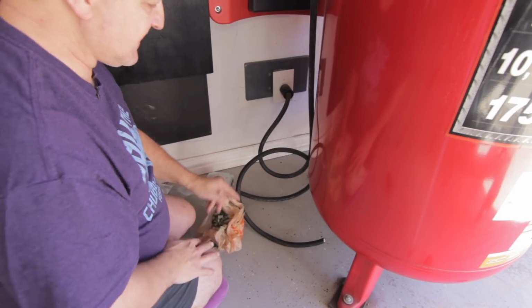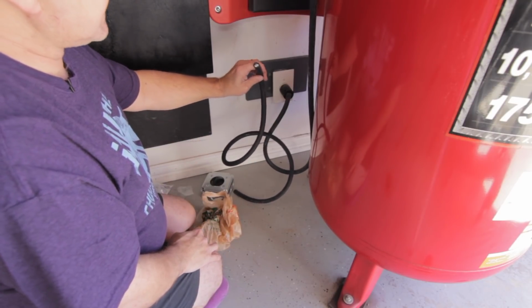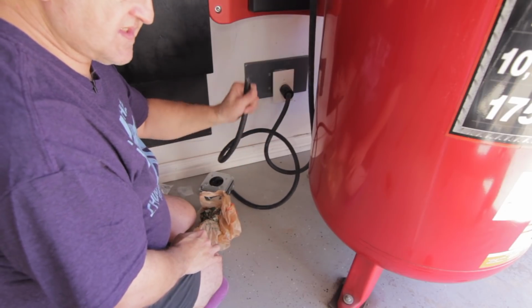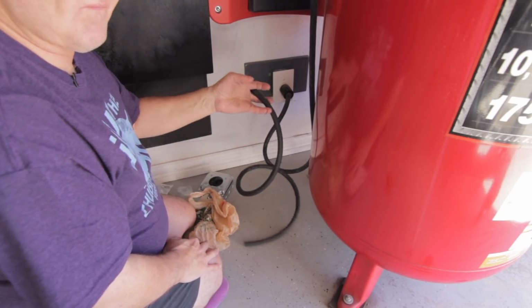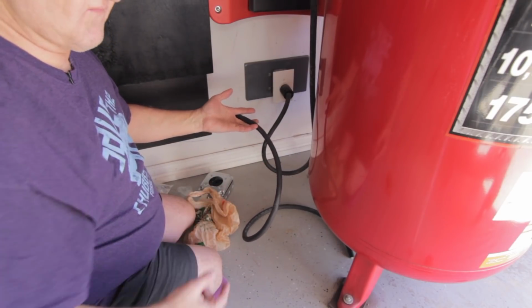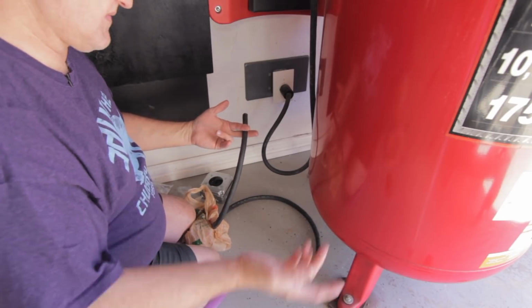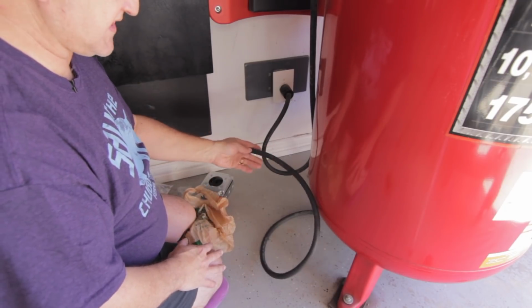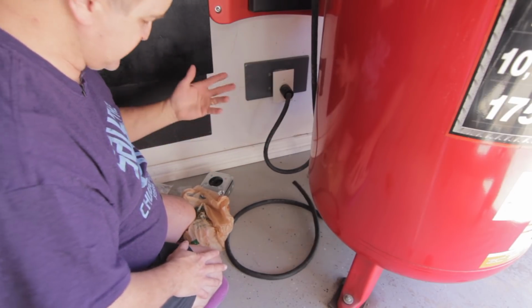The other thing that I've realized, since I'm going to be using 220, this here is 10 gauge wire, but the cord on the welder is only like 5 or 6 feet. So in order for me to get all the way around the Mini, I'm going to have to build an extension cord. That'll be a future project. I'm going to go for a 20-foot extension cord, which should be good.